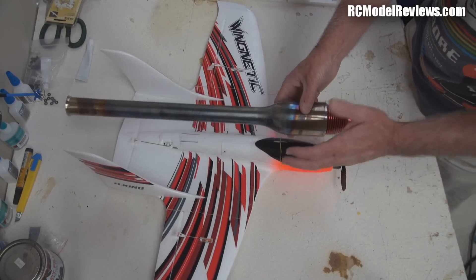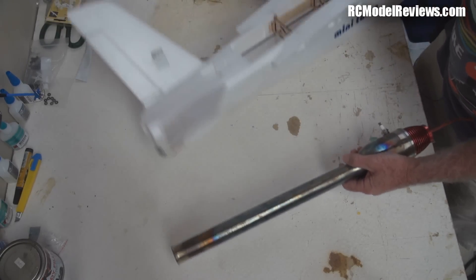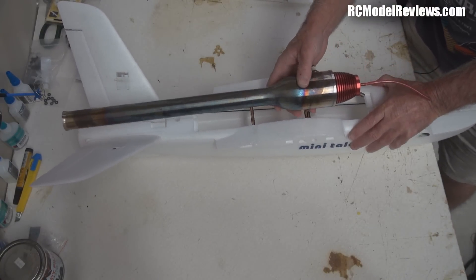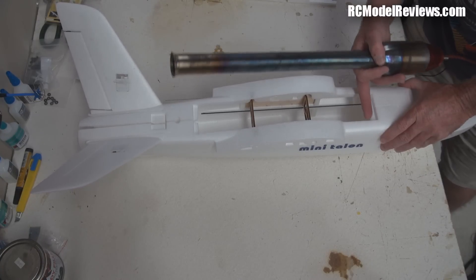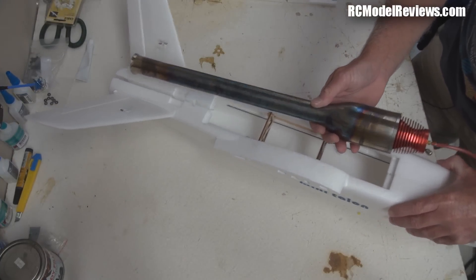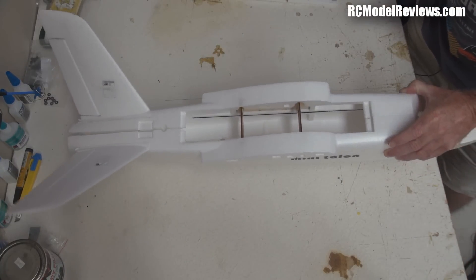This really just didn't tick enough boxes, and that's when I saw the Mini Talon, because it has the next best thing to twin tails - it has a V-tail. The goal here is that we can mount the pulse jet up here so it will be about here, meaning I can put the fuel tank directly underneath. The tailpipe of the pulse jet will go between those two fins, and thus we hopefully won't set fire to the model.